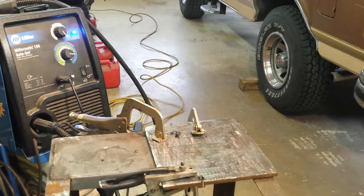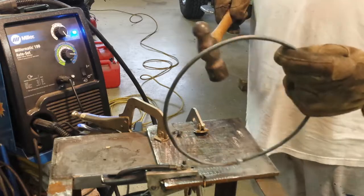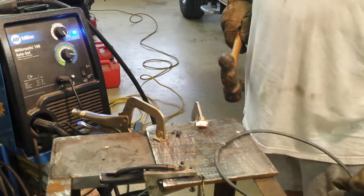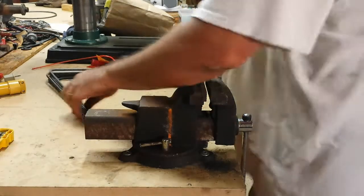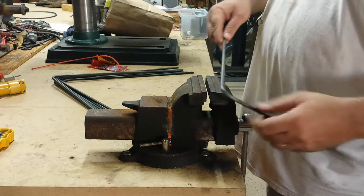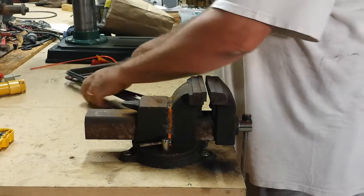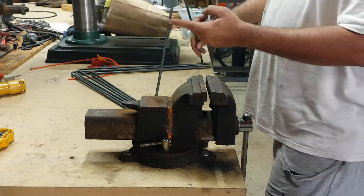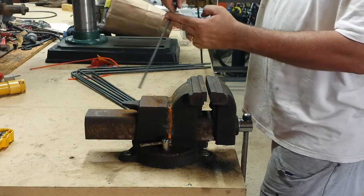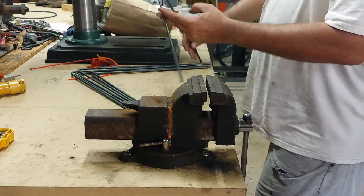I can grind that down, but I've got to practice. These cool little projects that don't matter — that's a good thing for me. That looks pretty round; that's going to be good right there. So I forgot to hit record, but there they are. All I did was put the mark right here — just a little bit past the end — and bent it around until it touched the edge right there, and that was about right. They're all roughly the same. 30 inches was too long, so I'll end up cutting this off somewhere around here to be the welded part, and that way it'll be up off the ground or off the table.